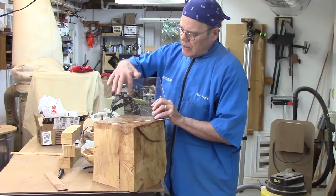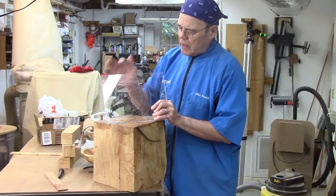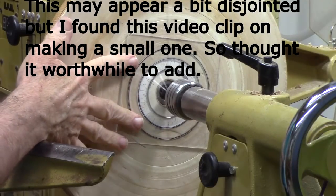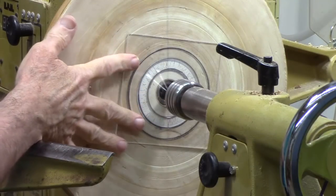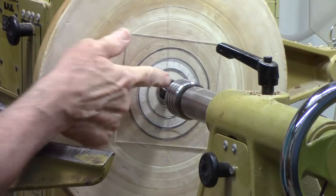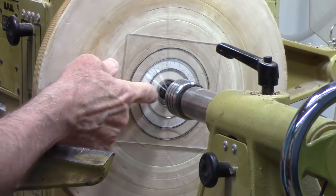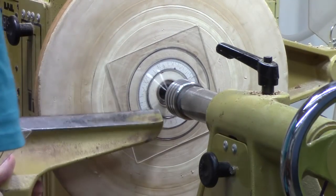But I just want to point out again this handy thing you can make out of a piece of acrylic. Drill a hole — you can actually put this on a large backing faceplate and scribe these lines with a skew or a point tool while it's on the lathe. I occasionally need to find the center of a small block of wood, and the easiest way I've found is to make a small template like this. I had some scrap acrylic, drilled a 5/16 inch hole that I could put an awl through, and measured out at three inches, three and a half inches, and four inches, simply marking with a felt tip pen.